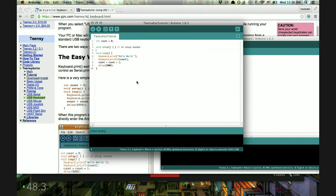Keep in mind that it will run as soon as the Teensy reboots after you've uploaded the code — which means if you hit upload and you still have this sketch open, right where the cursor is, it's going to start printing "hello world", "hello world", "hello world". As I found out, that's really annoying because it's modifying the exact code you're trying to load onto itself. It's like some cyborg evil thing from the future — your terrifying cyborg future is now.